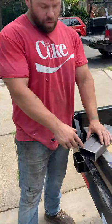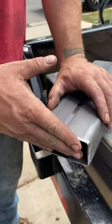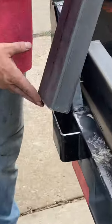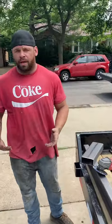When working on stuff, it's always a good idea to put a bevel on whatever you're welding. What a bevel does — it allows more penetration on your weld. You put a bevel on this piece and a bevel on that piece right there, and when you go to fit it together, you get a lot more penetration. The more penetration you've got, the more strength you've got.